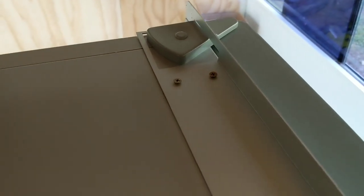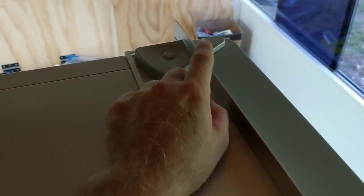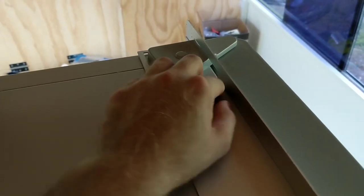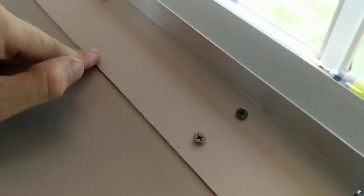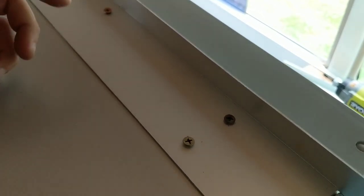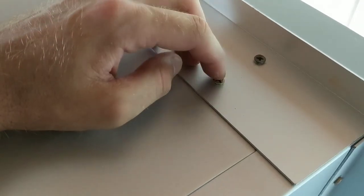I've just attached the Evercool mounting kit to our fridge. It comes with three pieces of angled aluminium — we got significantly more pieces, but we spoke to the Evercool rep and he said we weren't supposed to get half of them. You're supposed to get three, maybe four if you get one of the top pieces for each left and right hand side. The hole just needs to go over the rotating bit and then it goes down. The aluminium comes with pre-drilled holes but there are no holes in the top of the fridge, so the Evercool guy said you can drill through a couple of centimetres where the holes are. We used 20mm countersunk screws — five at the top and four down each side.